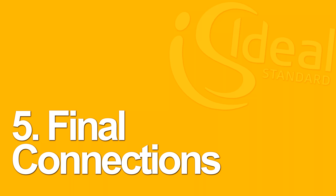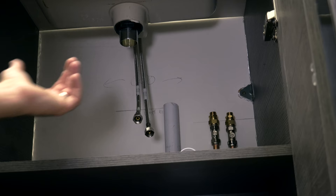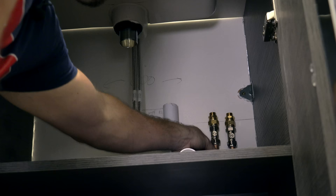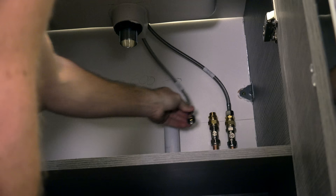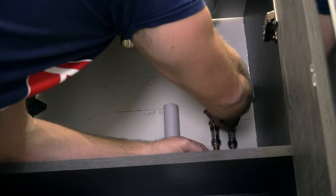So let's get our pipe work down here sorted out. Look at how our measurements have worked out — we've got rubbers on here. We've already pressure tested these. That's just going to pop on there like so, and we're done up — nice and easy. Both water connections are now done. I hope you've recognised that because we put those pipes in and put the valves on before we put the vanity unit in, it meant we could pressure test our pipe work before installing the unit. The last thing we want is to pressure test it now and find a leak down the back and have to take the whole vanity unit out. So do things the right way round — you're making your life easier.